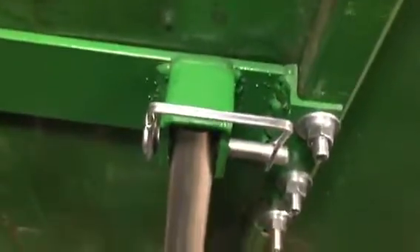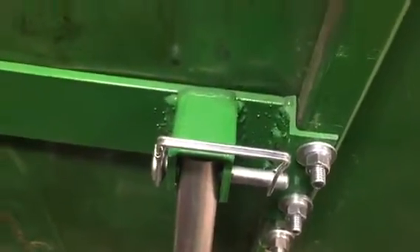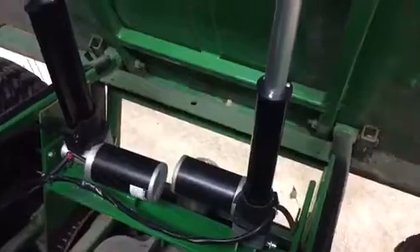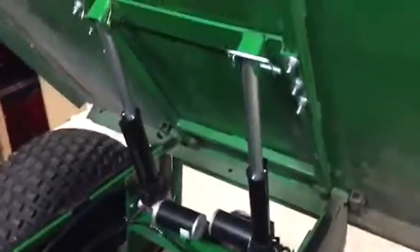But this is an optional solution if you cannot obtain a hydraulic kit — you can use these actuators. I also used an existing salt spreader wiring that was on here. I gutted the spreader since it's no longer in use, and used the wires running from the positive and negative battery. I just replaced the spreader switch with a 30-amp toggle switch, which you can purchase along with the IR10 actuators from Northern Equipment.